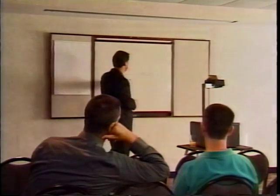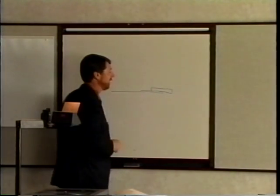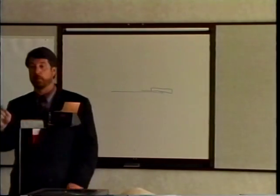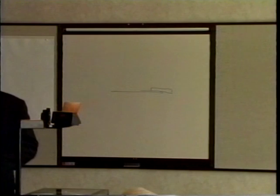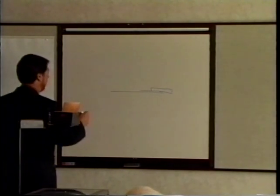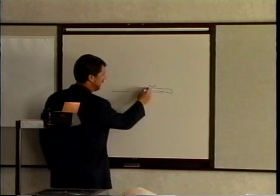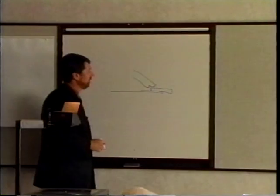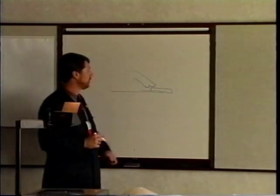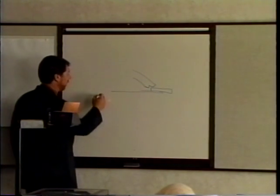But now we want to move that stone. We have the shellac off, and we want to push that stone out a little bit. We don't have deep enough lock. You don't want to use anything metal because you can chip the stone real easily. So I always have a piece of peg wood that usually has some sort of a dealie like that shaped in it, so I can cover the stone. It gives me a little bit of control pushing back.